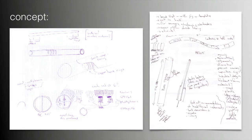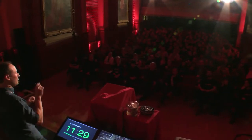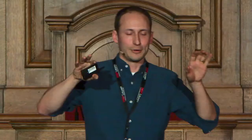We decided to go with a tube as the shape, and packed all the electronics into a piece of plumbing pipe that I cut in half, coated in rubber shrink tubing to make it sweat-proof and mostly waterproof, and quite strong. We used sensors designed for microwave oven control panels but overclocked so they would be much more responsive. We made custom pressure sensors out of conductive paper, put in inertial sensors to sense movement and orientation, and also a contact microphone designed to sense tapping — though the musicians quickly figured out it would also sense twisting. All of the sensor data is gathered up and massaged: from orientation and movement data we can extract jabbing, sweeping, and swinging — descriptions of gesture. From the touch data we get not just touch and release, but also gripping, cradling, hugging, brushing.